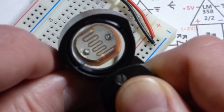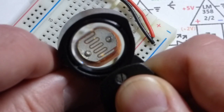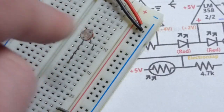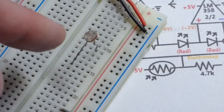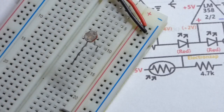Now there are some that have slightly different colors and the lengths of the lines might be different — the squiggles might be bigger or smaller. So they don't all have the exact same resistance at the exact same light level if you use a different part number. But they all respond the same way: resistance goes up as it gets dark, and resistance goes down as it gets bright.